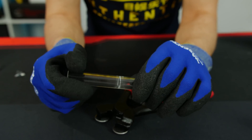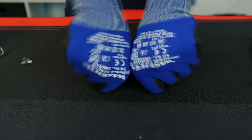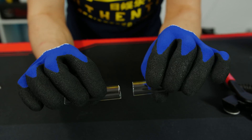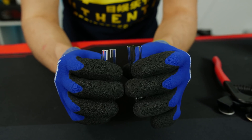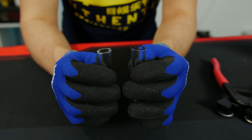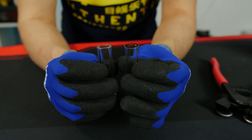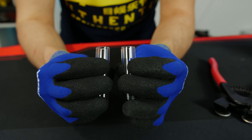Let's just try to break it and see how it looks. Cutting result is better than I expected. Even though the cut was quite deep, it was extremely hard to break the tube. It's still far from a perfect cut but I think this is about as good as we can get with this tool. It's not much better than the original DIY glass cutter we built and optimized with the better wheel. Using the torch afterwards should still make the edges fine.